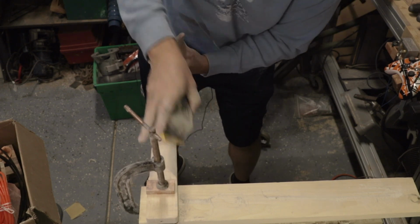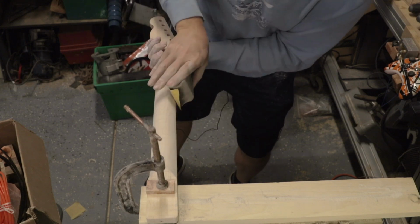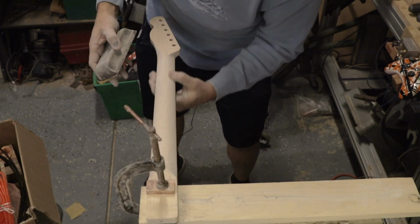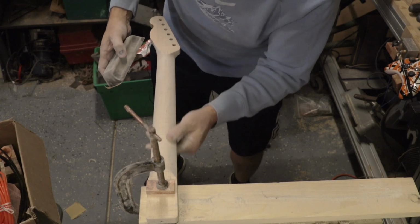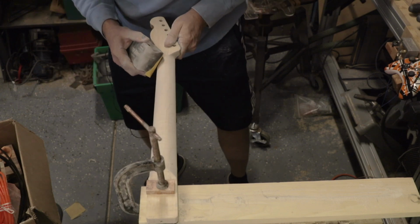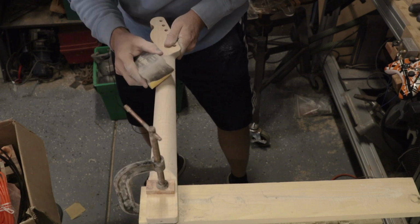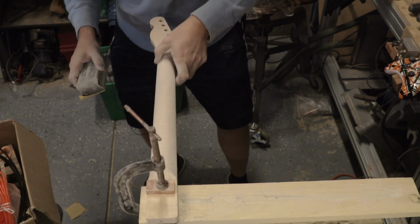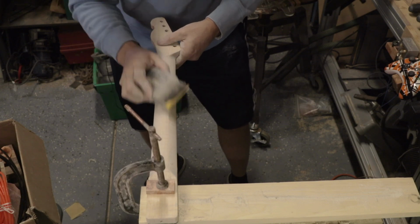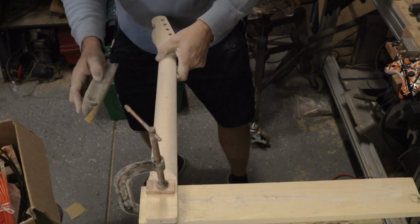And again, this is being honest with yourself. You can say, oh, I think the paint will cover that up, or I think I'll get it when I'm doing 320, or whatever excuse you want to come up with. Believe me, I've had them all. And the right answer is you fix it in 180 so that it feels like the rest of the guitar. And then when you get to 320, it'll be perfect. It'll be so much easier. 180 removes material so much faster than 320 does.